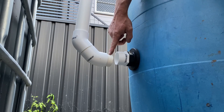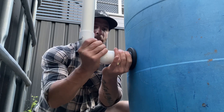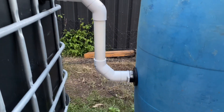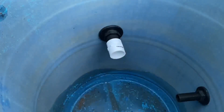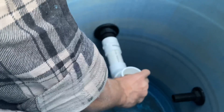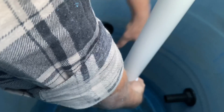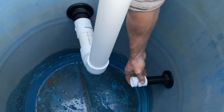Once it's attached, we take our 40mm pipe coming out of the 45 degree angle elbow and position it inside the adapter. Now when it comes to installing the internal pipework inside the radial flow settler, we want to take a 40mm threaded female adapter and thread it onto the bulkhead fitting. From there, we use a section of 40mm pipe to attach a 45 degree angle elbow into the adapter. We then take another section of 40mm pipe in order to install yet another 45 degree angle elbow, again giving us a 90 degree turn. From there, you want to take a vertical section of 40mm pipe to act as a stand pipe inside the radial flow settler.